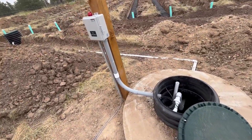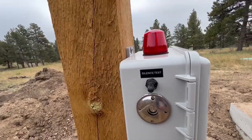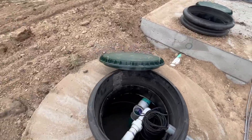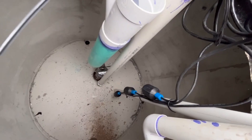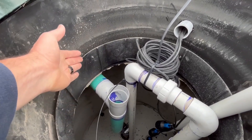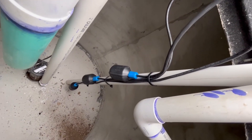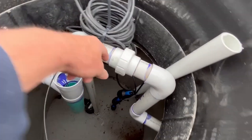This one's a little different — we've got this sweet box. Test it out, flip that switch, it's gonna run. We've got a pump in here. A lot of septic systems — they all have some kind of pump. You can see the utility pump down there. Once the water hits a certain height, kind of like a sump pump, you can see our inlet valve. All the stuff comes in and just drops in there. We've got three floats — once those floats are triggered, that water gets pumped and circulated through this pipe.